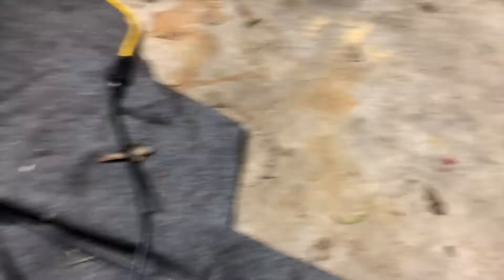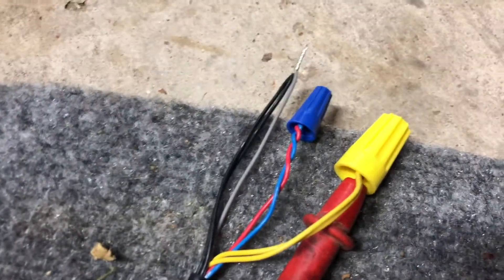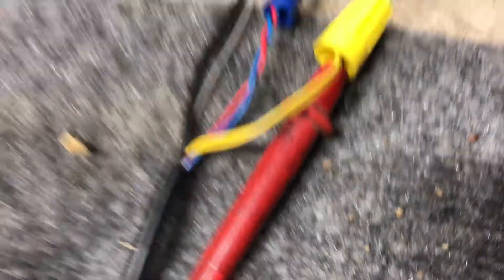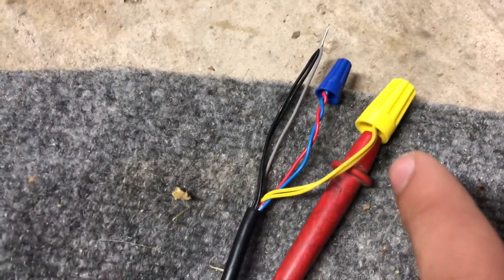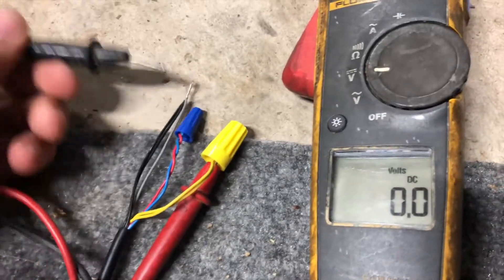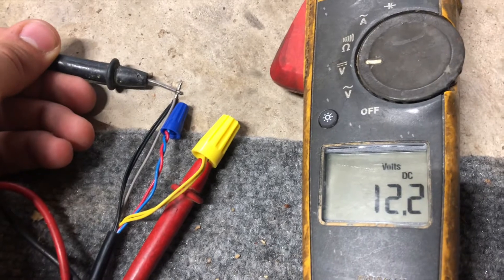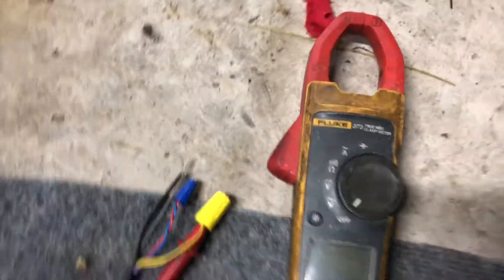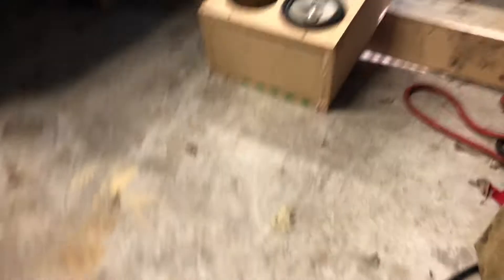Here's where we are right now. I've got it plugged in and the green light is on. The red and blue are tied together, giving it the signal to turn on the power supply. The two yellows go to the positive lead on the meter, all the grounds are tied together, and when I touch the grounds it reads 12.2 volts.